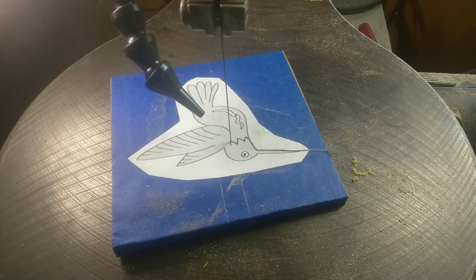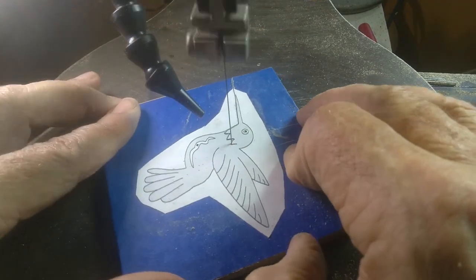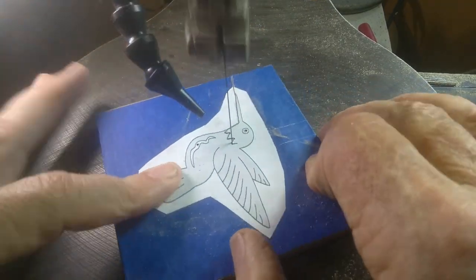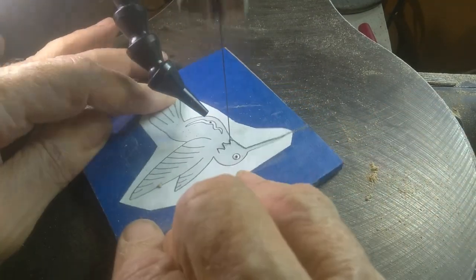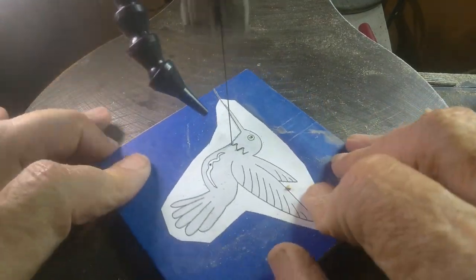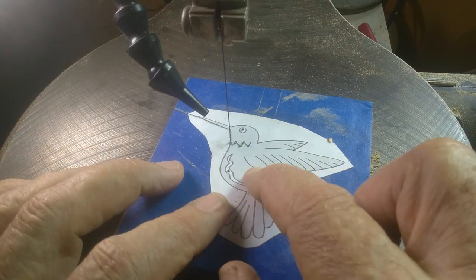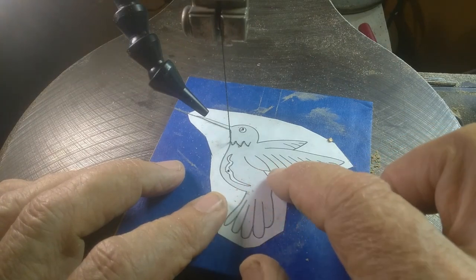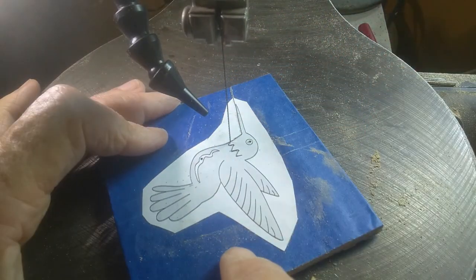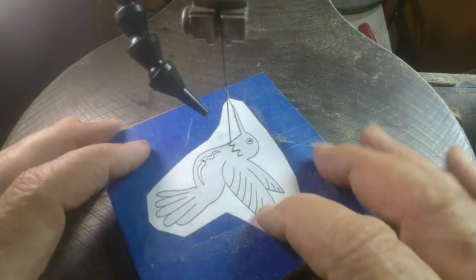I made all those turns, now I'm going to go out without turning the blade around. Line back up and just go right on with your cut. That's what I do with each one of these veins — I go in and back out. Now in this case it would actually be better to come in from this side, then you're angled for these pieces. Those are things you can look ahead to before you start cutting.